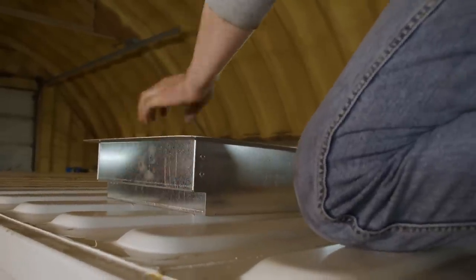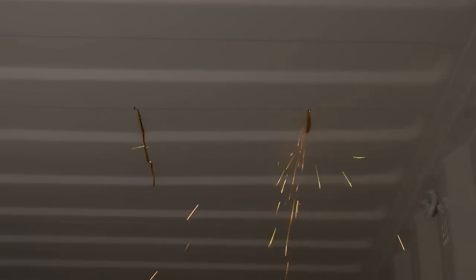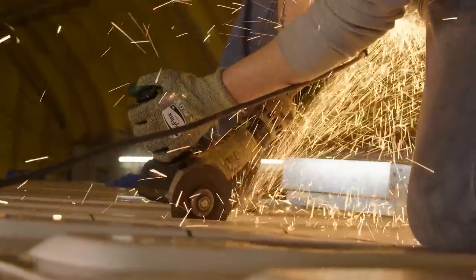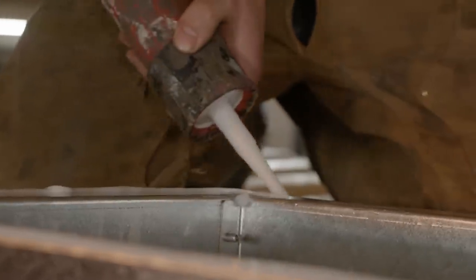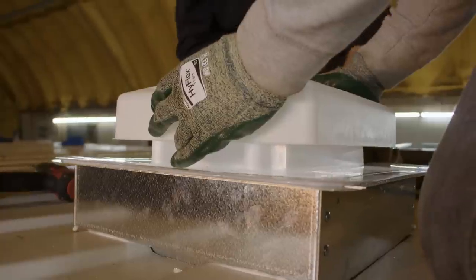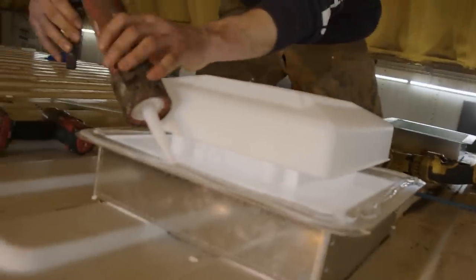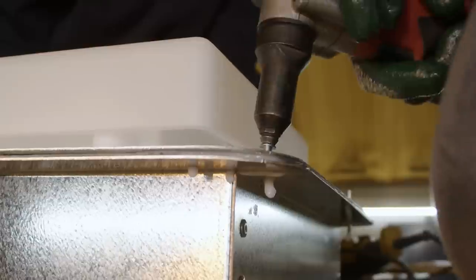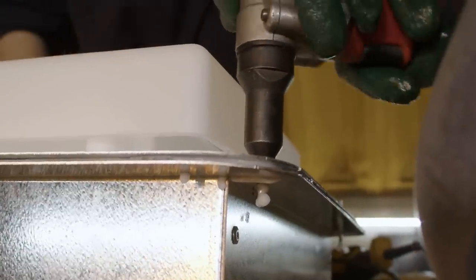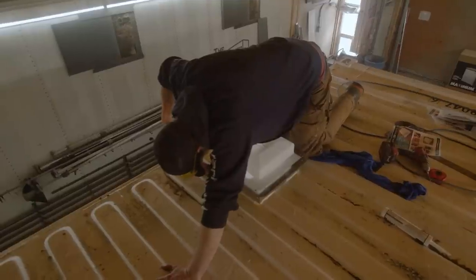With these mods we always start off by cutting out all of our rough openings and performing the exterior modifications, such as the skylight roof vents which Josh and William are working on here. A quick tip: once you've cut the rough openings, immediately sweep off all the metal shards on the roof of the container. The bare steel will rust when exposed to water and can stain or intrude through the coating and cause premature rusting on the roof. Sealing the skylight vents up is the most important thing — I'm not a huge fan of cutting holes in the roof, but customers always seem to require it, so all we can do is our best to ensure these vents don't leak over time.